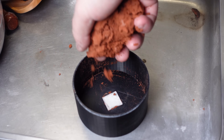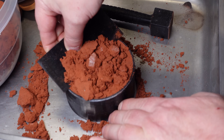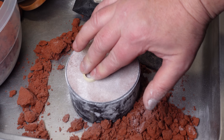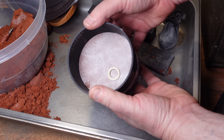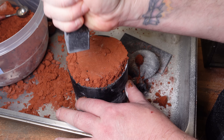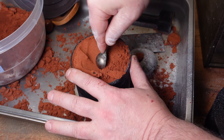We'll start with the casting attachment — this is probably the easiest method for turning 3D printed parts into metal. You start by filling the bottom half of the mold with Delft clay and packing it really well. Then you take your 3D print or whatever you want to cast and push it about halfway into the sand. Dust it really well with talcum powder, then attach the top half of the mold, which has a key to keep it in the correct position. Fill the top half and pack it well, then scoop out a concave shape to help the molten metal flow.